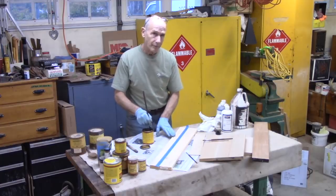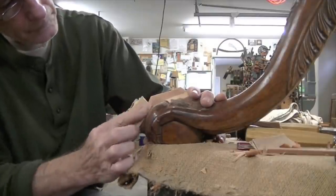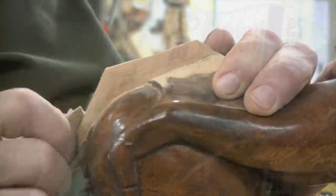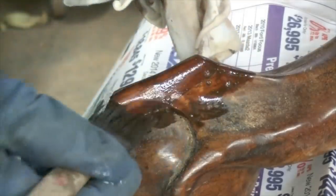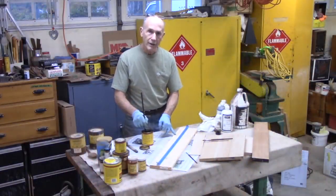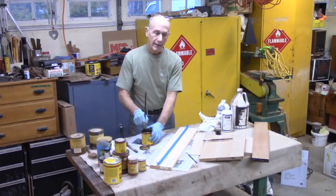This is a piece of pine I'm going to try it on, and how well the wood is sanded matters. Oil stain pigments are larger molecules that depend upon the scratches, the grain, and any other defects in the wood to grab hold. So we have wood sanded to 100, sanded to 150, and sanded to 220, and we're going to see what the different effects are from one stain.